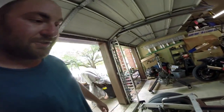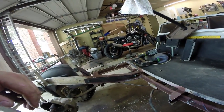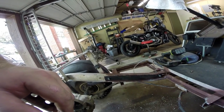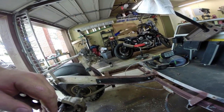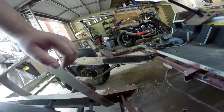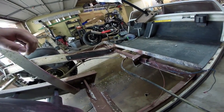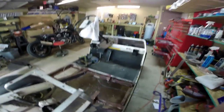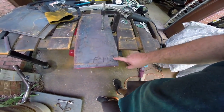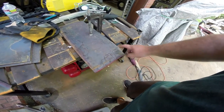Sorry guys for not filming as much as I normally do — I'm just not in a great mood today, and working on projects really kind of helps a lot of that. The bolts I found are obviously too short, because there's no point in using locking nylon washers if you don't have a bolt that's long enough to reach the nylon. They're the right diameter, so we'll just leave them in there for now. We've got to get some cardboard cutouts that are going to fit right here. We're going to run a brace across and then back to make as much space as possible here. Here are the two end pieces we need — this one's basically just straight lines, this one has a little bit of a notch to it to maximize surface area. We've got to fit two bolts plus a welded plate onto each of these.